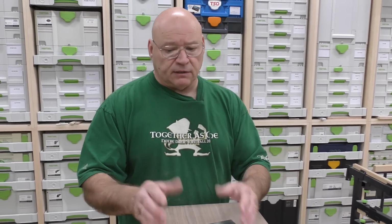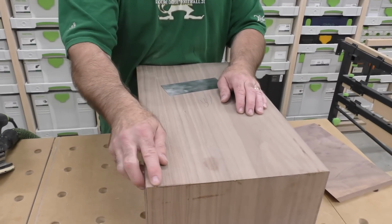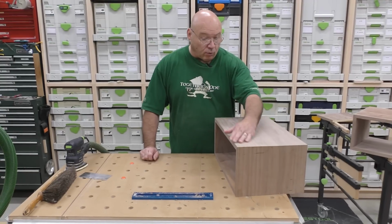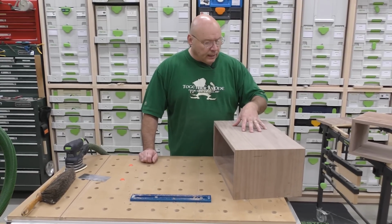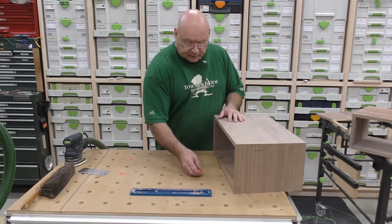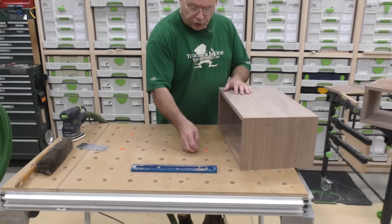You take a very aggressive sander and you start sanding here because you want to get the marks off. And what happens is you burn through and you can see the plywood core underneath. So just take your time in doing this. Okay, so I just scraped what I could see with my bare eye, the glue residue. So what I'm going to do is give it its first initial sanding.